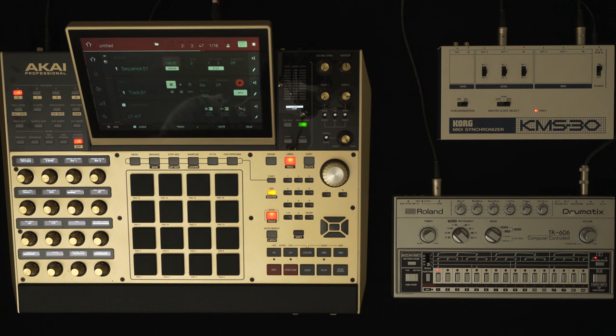You can also use the tape section on the KMS-30 to record timecode onto an audio track of your audio application. This gives you the ability to sync something like an 808 back up with your project later, or you can multitrack a 303 over the top of itself as many times as you like. Just make sure you record plenty of level and don't be afraid to push the timecode audio signal into the yellow or orange — just don't distort it, but give it everything you've got, because the KMS-30 is going to need a very loud level to pick that timecode back up again.